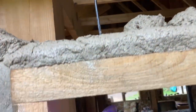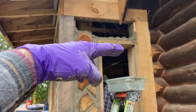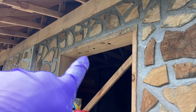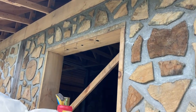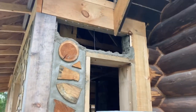And then I also installed really long 18-inch screws, because this is a foot. All of our windows are a foot down from the top plate. And I attached those screws so the top of the window does not bow. Depending on how long the window is, that one got 3 screws, never mind the little ones. I had a box up there to hang the window when we started mudding, and once we get so far, I remove that box. That's what those little screws are for. But the big black ones are those.